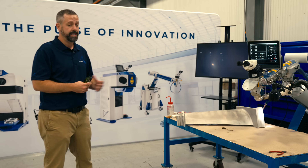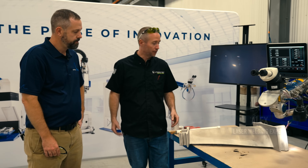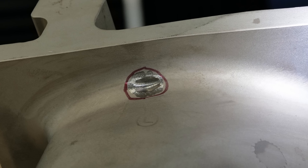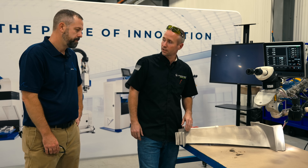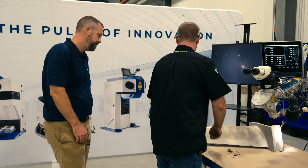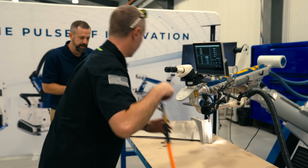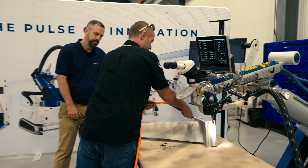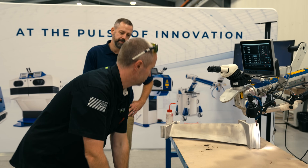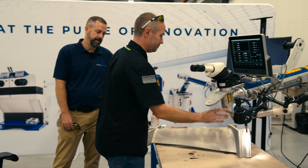Alex is going to be welding with us again today. Pretty much the same thing as the last blade or vane we did — you've got to make sure the area is prepped clean. That was already ground out by the customer. We're just going to wipe it off, brush it out real quick, and then put it under the laser, cleaning with acetone. It's critical that you remove any ink or markings from the weld spot — we want all possible contaminants out of the weld. It matters even more when you're welding with small diameters and a smaller welding area, because the percentage of contamination would be so much more.